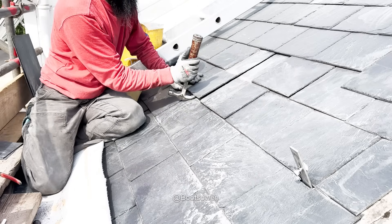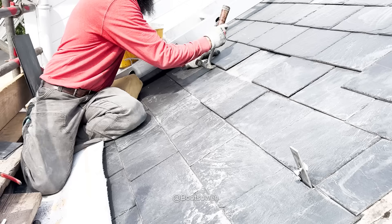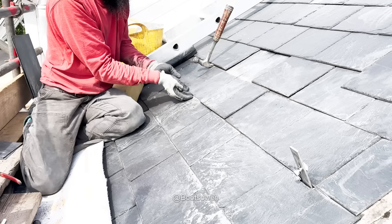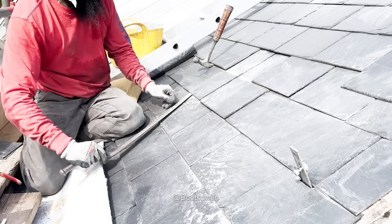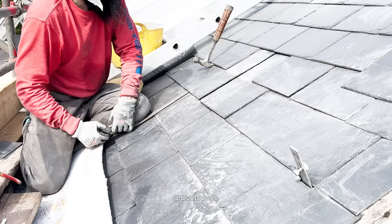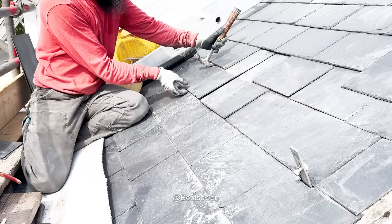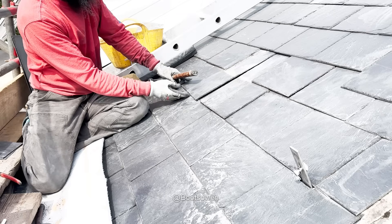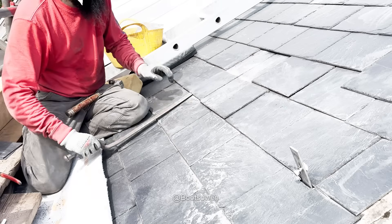At this point in the video I was contemplating rotating the slates out of the way — you leave one nail in and rotate these two slates out of the way — but then I changed my mind and went to ripping this one out. I was trying to rotate it and then just changed my mind, stuck the rip in, pushed it up to free the nail. I started to rotate it, changed my mind, and ripped it out, as I realised I have to cut below it with the angle grinder anyway, so it might as well come out.